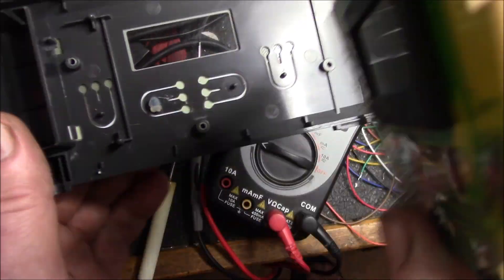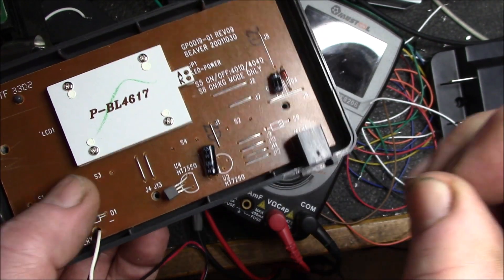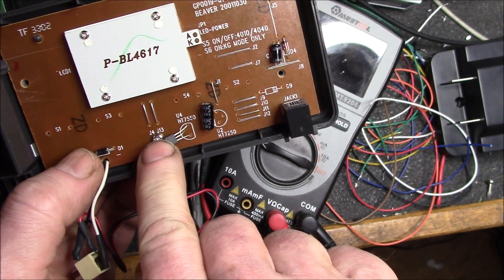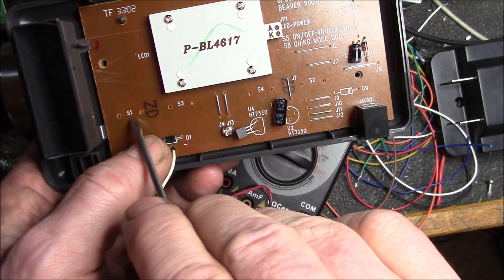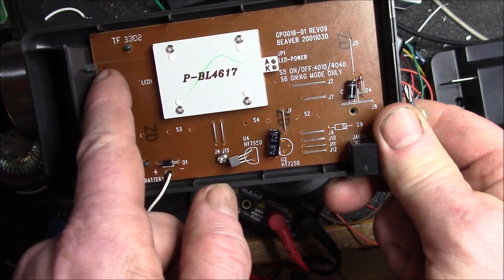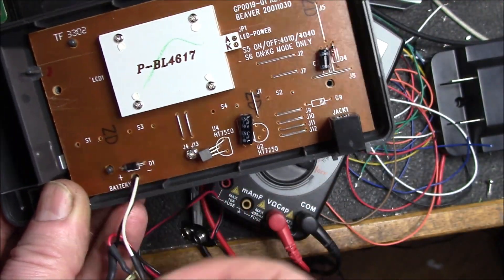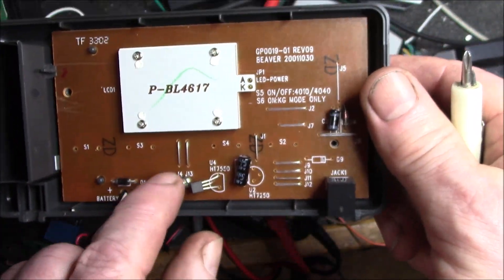I tried it last night and I had too much on there and it wouldn't release the button. I've melted a little bit of the hot melt glue off the end. The other problem I found: there's a screw right there, switch three is the on switch, switch four is the off switch. One problem is there's only one screw holding this circuit board in — there's a little tab and a couple of pins, but if you press on the button the circuit board can flex a little bit, so I think that might be part of the problem.